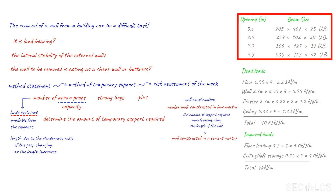We have undertaken the design using BS 5950 and assumed that the floor joists offer no intermediate lateral restraint to the beam. The above loads are unfactored loads. There is a practical aspect to the design: to ensure that the beam width is similar to the wall width, particularly if it is bearing onto a wall running parallel to the beam, otherwise the edges of the beam will be overhanging the edge of the wall.